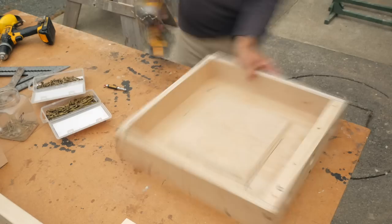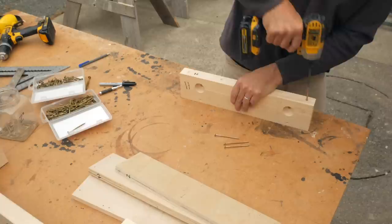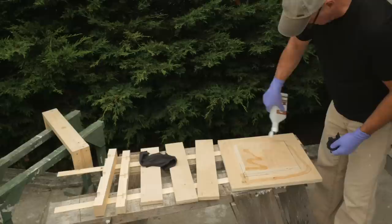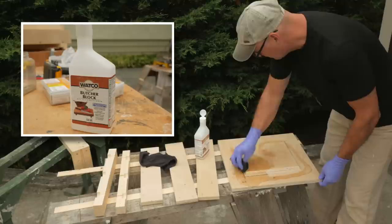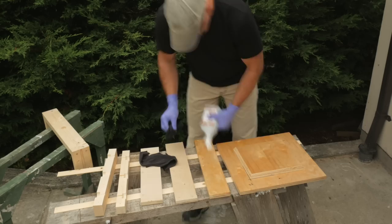I take the forms apart before I coat them with oil. I also disassemble the bolt block to get oil on all surfaces and seams. I had some mineral oil left over from making the garden box forms — this oil is sold as butcher's block or cutting board oil. It's fast and easy to apply and seems to work well. Mineral oil can also be bought from animal feed suppliers or in drug stores or pharmacies. I apply it to all faces then leave overnight to soak in and dry to the touch.